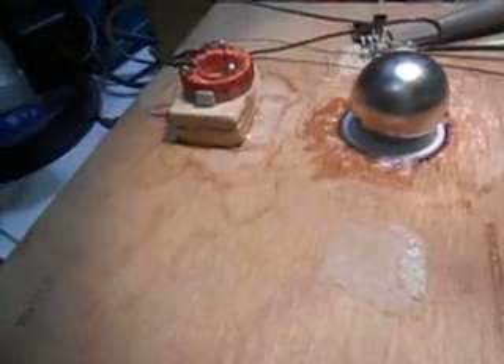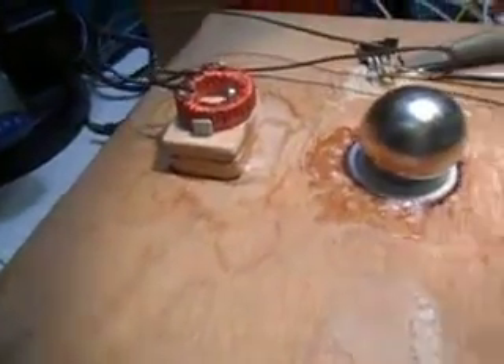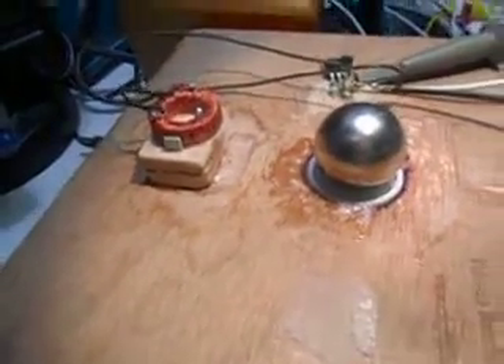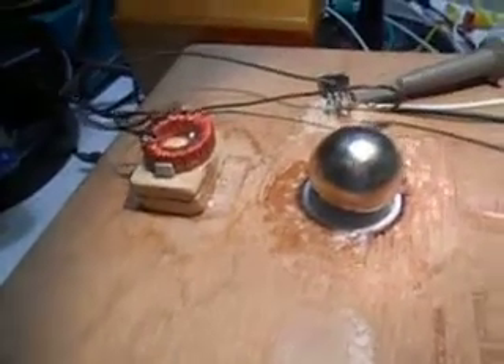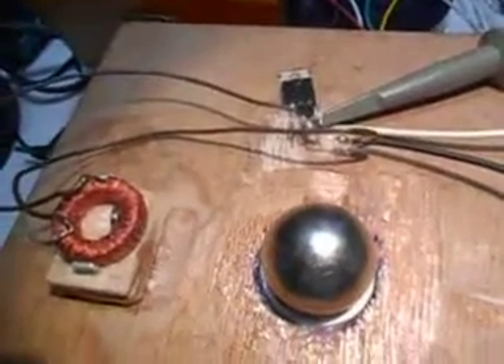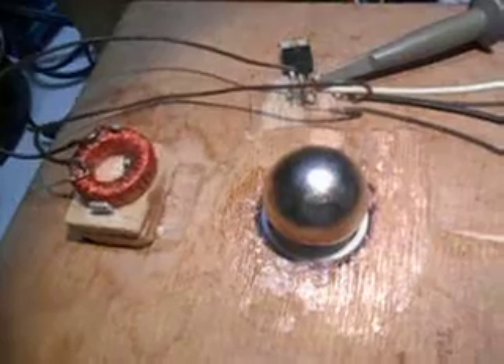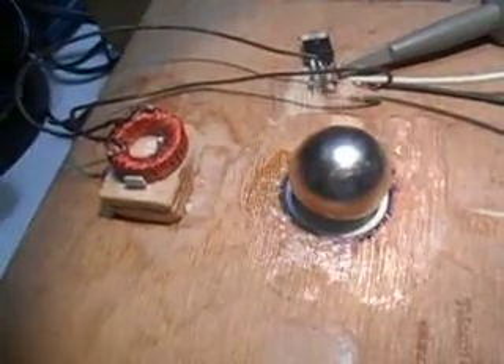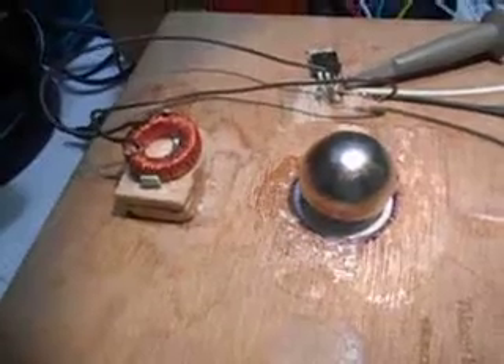It is so strong that if I put this core in closer, the core itself overheats as this magnet spins. I never anticipated this. And you can see how far away the sensor is to sense this thing. If I get it any closer I get a pure 50% duty cycle and there's quite high current in this particular coil.